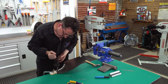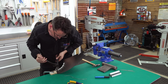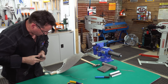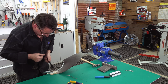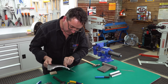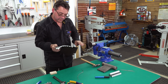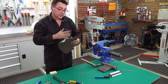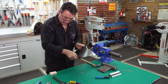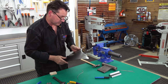With this method, you need to over shrink because it's quite easy to stretch it back out. You can really see how much radius that's pulling through there. In this direction here, right now, we're getting very close. As soon as I start to smooth it out, it will undo some of the work. So it's a multiple step process. I'll shortly be stretching this outside flange so that we can start to meet or match these faces up together.